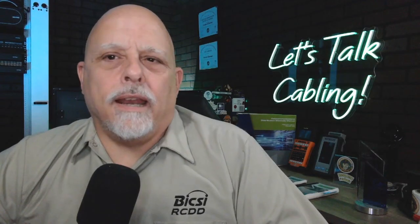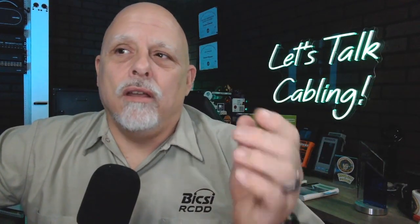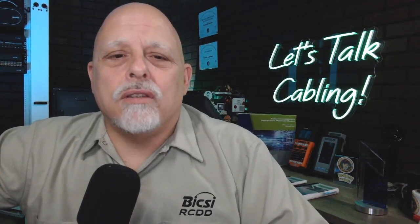And as a result of that, a fusion splice would have less loss, correct? Correct. And I would assume since you're fusion splicing the glass together, it's a stronger connection than... It's a better connection. But just think about taking two pieces of metal and welding them together. You're doing the same thing with glass, but you're using an electrical arc to create that connection. So when you fusion splice it together, you're still going to have some loss.